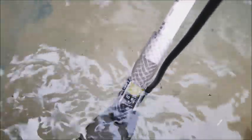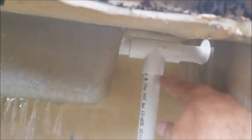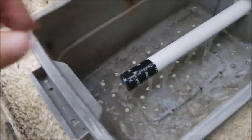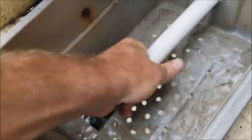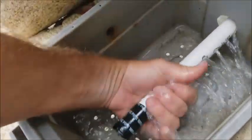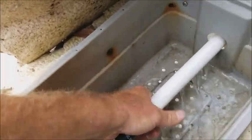I got it running to a piece of one inch tube right here, which fits perfect over a three quarter PVC. That's going to run up to a T right here, and then you got a hole in that box and a hole in that box. Cap the end off with some duct tape or something if you don't have any caps, and then you drill some holes kind of like that. I like a 3/8 inch hole, just to pass debris, scales and whatnot. You can take these off and clean them if you need to.